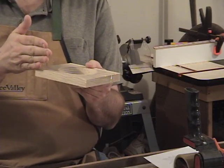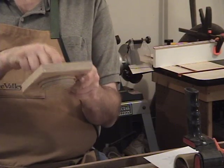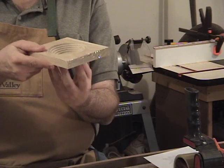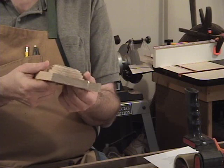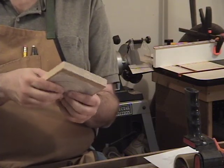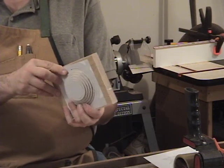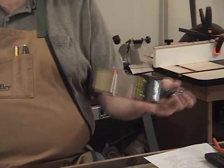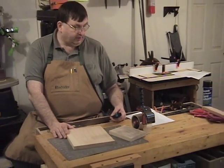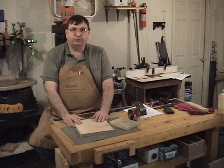The shallower you set the angle of your table, the deeper the bowl will fall out. If you get it too shallow, it'll just be springy, and obviously we don't need that. We want something that when we push it open, it'll stay stuck open and come out to make a full size bowl. Go ahead and make this test cut until you're comfortable with the depth you get. Keep in mind that if you change the thickness of the board or change to a different size blade — for instance a number nine — you're going to remove more wood and the depth of the bowl will change. Get some scrap wood and test this cut before you begin on your project. Other than that, we're going to need our clear box tape because we're cutting pretty thick material and we want to keep the blade well lubricated. I'm going to apply the pattern, take it over to the drill press, make our interior holes, and then we'll meet over at the scroll saw and begin to cut this pattern.